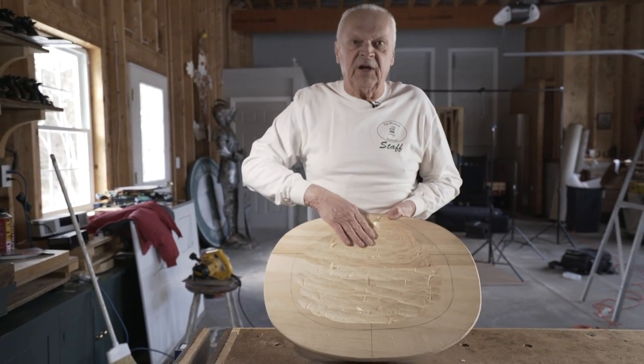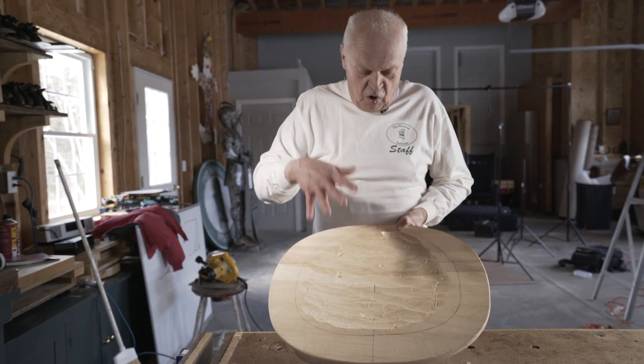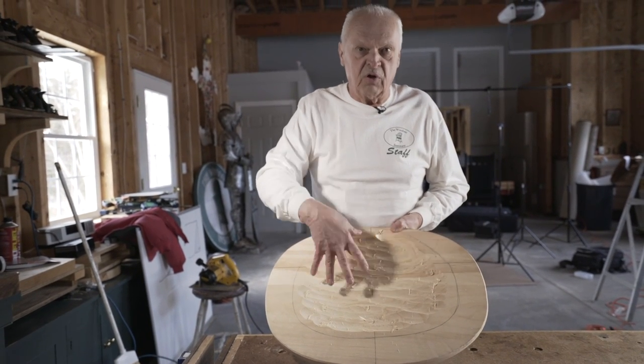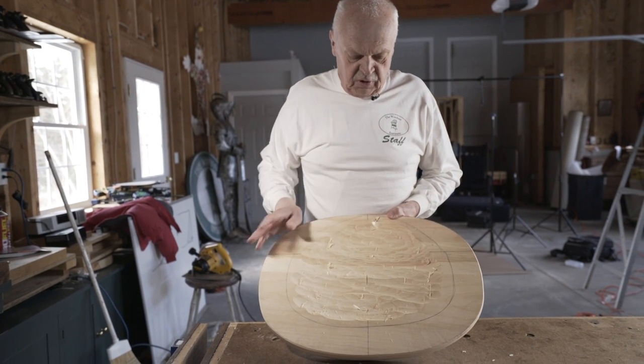This is the result of the gutter adze. Now it's not smooth — it's very rough — but that was the job of the tool: to get rid of a lot of wood quickly. Notice here what's left of the plunge cut.